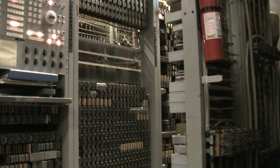The number 3 crossbar system's markers are what is referred to as combination markers, which means that they can set up a call for dial tone or complete a call within the system, or set up the proper information needed to complete the call outside of the system. In a normal number 5 crossbar situation, you would have a dial tone marker, and its only function was to provide dial tone or establish the connection for the dial tone, or a completing marker that would complete the call.